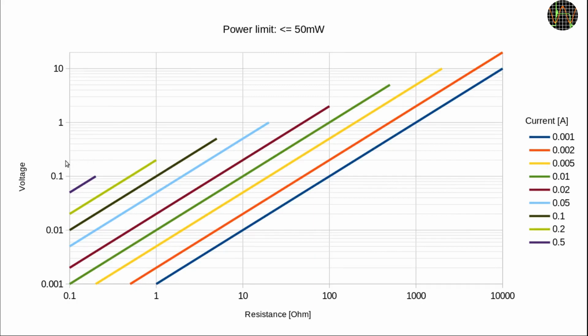As a rule, you need to have at least a rough idea what the resistance is before measuring it. If you don't, you can set the power supply to 10 volts and limit the current to 1 milliamp and simply use the resistance shown by the TC66 to figure out the rough resistance.